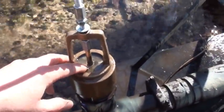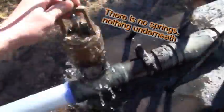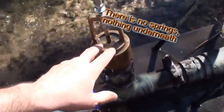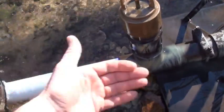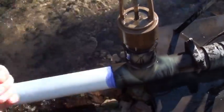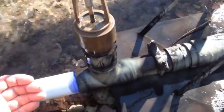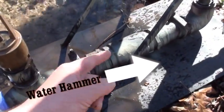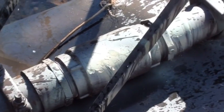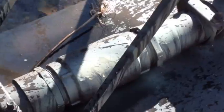This poppet for the check valve is weighted — you can see some weights here. Gravity will normally just open this and it'll fall. The pressure of the water coming through this pipe is going to escape out of this check valve. It's going to build up velocity and pressure in this pipe. When this check valve gets slammed closed quickly, it creates a surge of pressure that gets hammered through this second check valve right here. The water hammer pushes a quick surge of energy and water through this check valve.